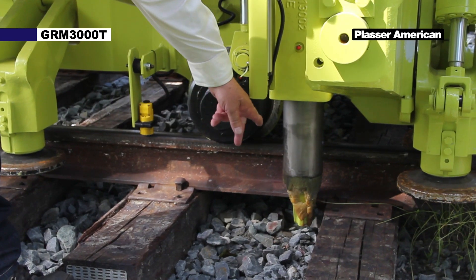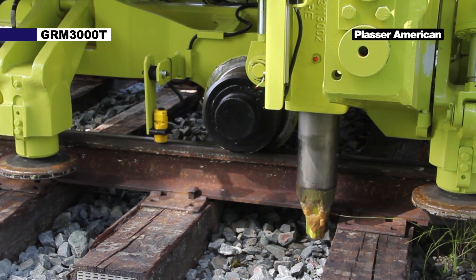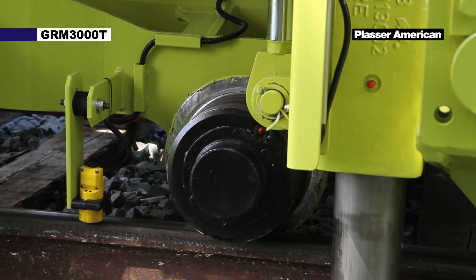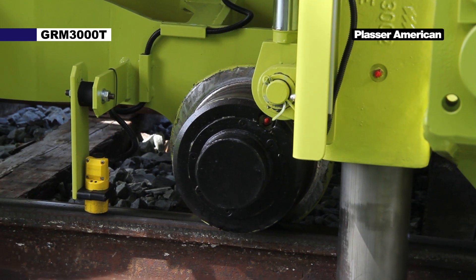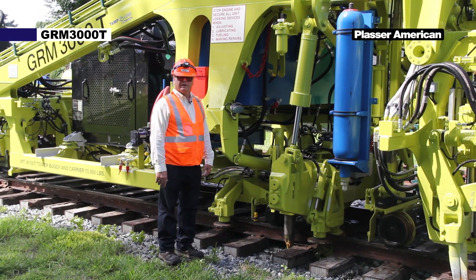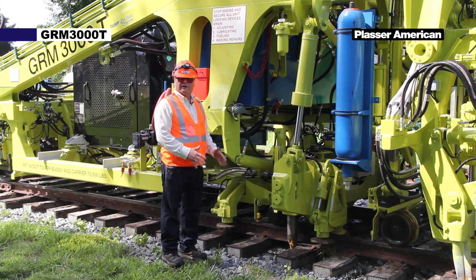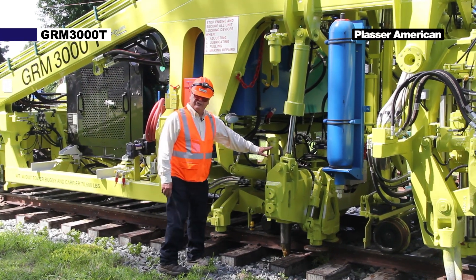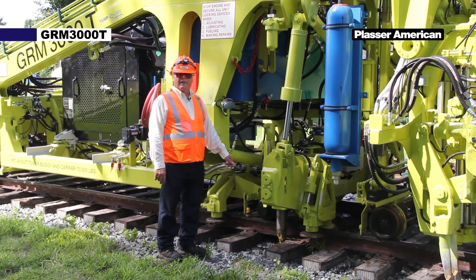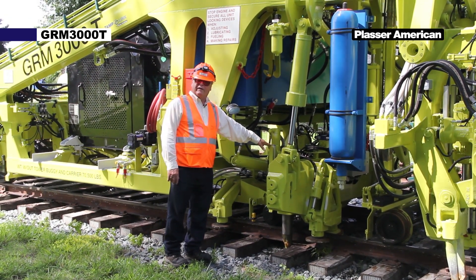Additionally, we have a rail hook. The rail hook is used in conjunction with the rollers, or used without the rollers if the rollers cannot be used. In the middle we have a lining roller, which can be viewed between the roller clamps. On the other side of the machine, the lining roller has a sliding axle which we call gauge comp. That gauge comp allows the rails not to spread when you clamp the rail with the hooks — it holds the rail still. There's also a depth transducer for the hooks. The depth transducer for the hooks allows the operator to set the depth of the hooks. The hooks can go down and hook under the base of the rail or the ball of the rail, totally controlled by the PLC touch panel.